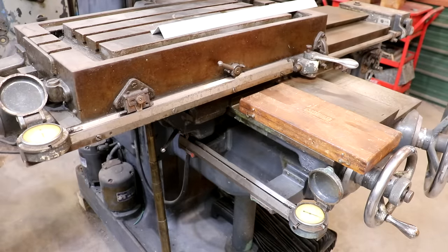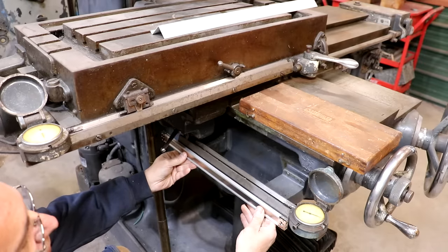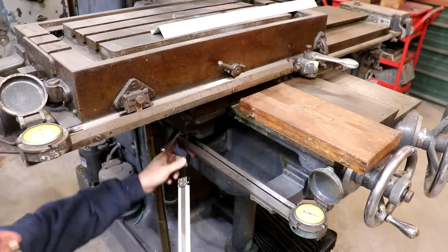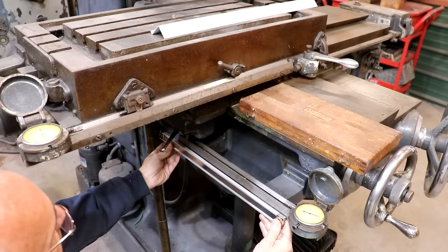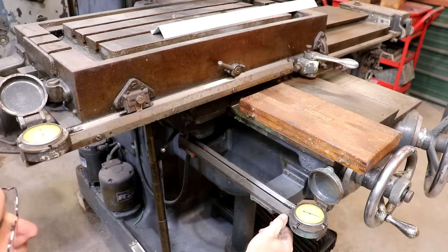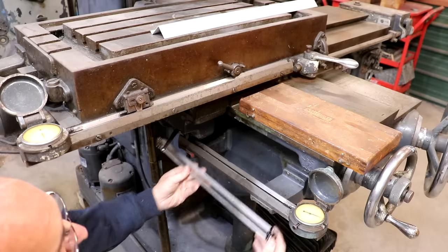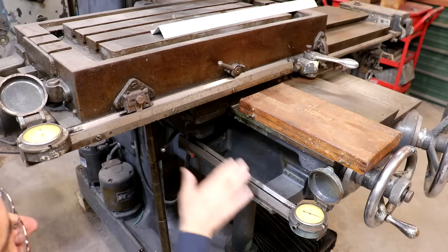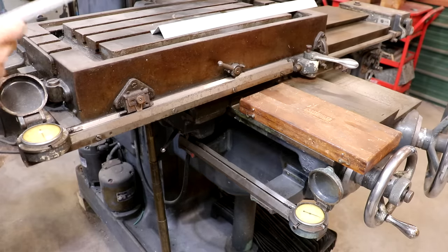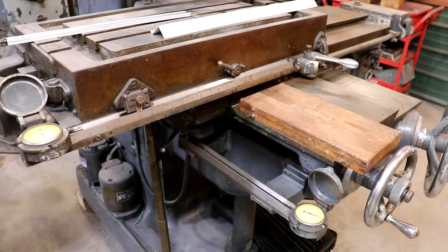Now I've got to get scales mounted on here. For the bottom, I'm going to mount a scale right here on this existing scale, and that's going to be my mounting point. This is the longer one, but we're just going to mount it right down here. I've got a piece of iron — about inch and a half by quarter inch thick — that we're going to mount on there, and then the magnetic scale will mount directly to that. We'll use these two existing scales to mount our magnetic scales on. That's the game plan.